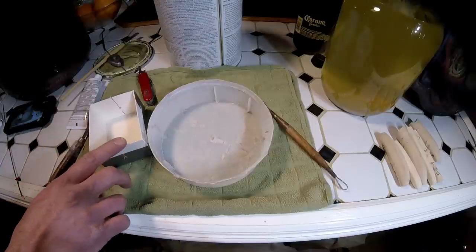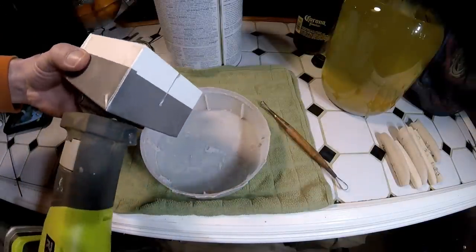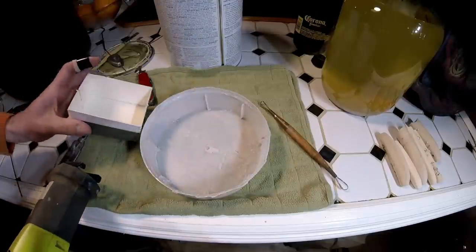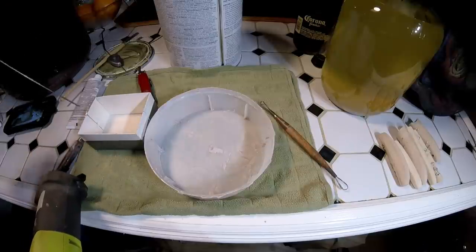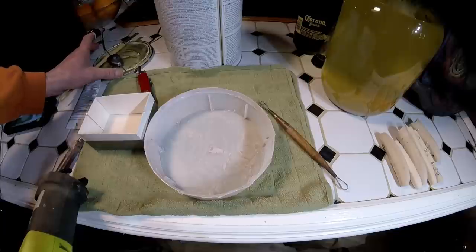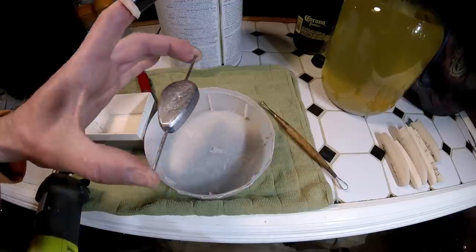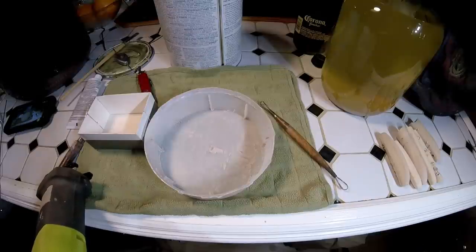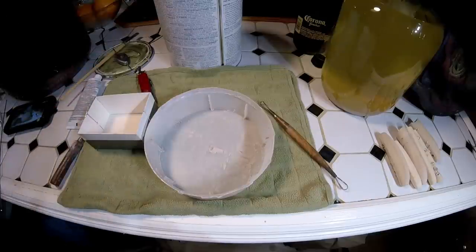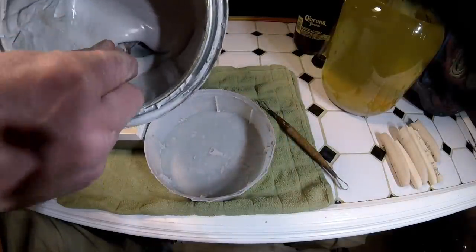After we pour it into this box, however, we're gonna go ahead and vibrate it. That'll bring the bubbles up. I have the other rod to poke the bubbles that are near where we're gonna lay the weight. I have the weight all Vaselined up, and I put it on a shorter rod so it's easier to deal with. And I Vaseline the wire up to the through wire. Anyway, we're gonna go ahead and add maybe like two and a half golf ball size pieces to this.